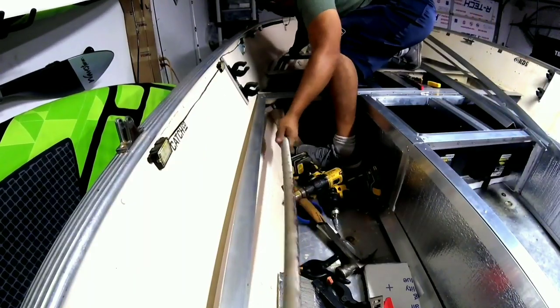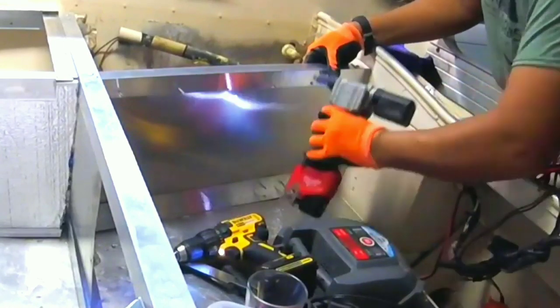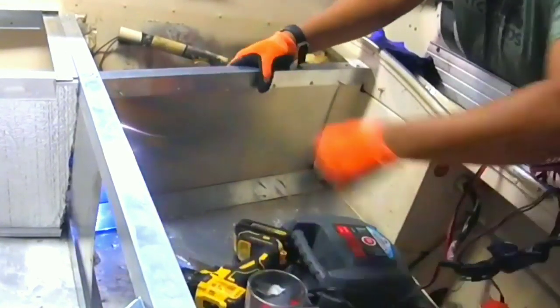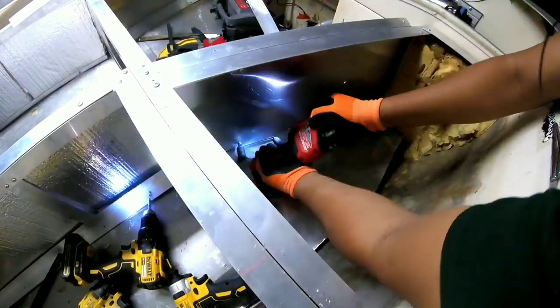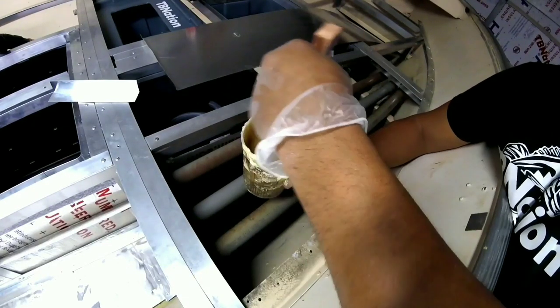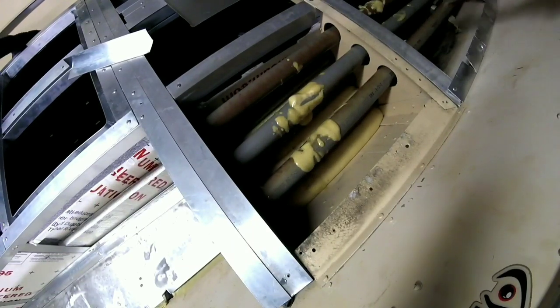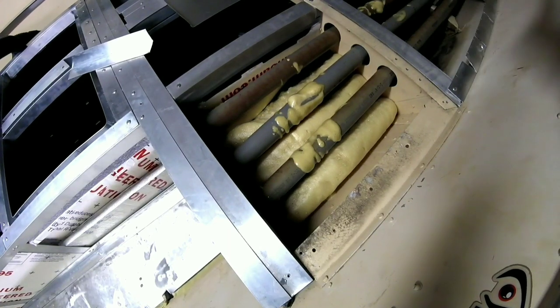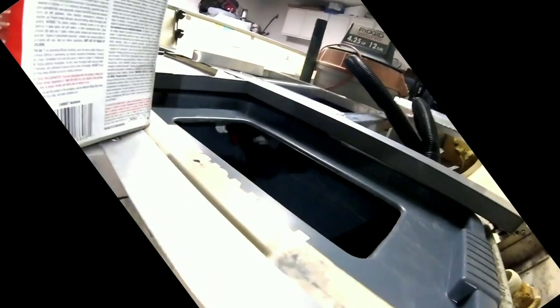Because we're getting a little ahead with the framing, we're going to have to run conduits. I really wanted to run two in that spot but it's not going to be possible — we can run one big one. Over here we're making the offsets for the foam again. We ripped out a bunch of foam in those sections, so we're going to add even bigger offsets to put even more foam in. This is the same 0.025 aluminum sheet metal that we're riveting to angle, and we're going to eventually be sealing it in with quad foam and then pouring. When we're doing this around the lockers, this is going to seal those rod tubes in place — they're never going to move again. This foam is going to fit right around those tubes, and those tubes will drain any water right through the foam into the subfloor and then out to the bilge.